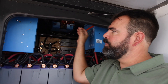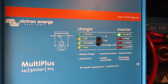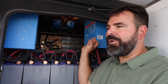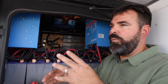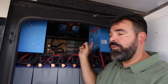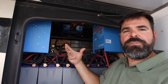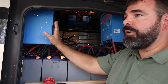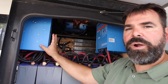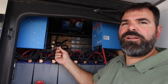These two big blue beauties are our Victron inverters — they're 24-volt, 3,000-watt inverters with a built-in 70-amp charger. They're set up in parallel right now, so they're working together. When one needs a little bit of extra help, the other will kick in and push all the available current to the necessary items. Right now these are running our air conditioners. One thing that's so nice about these Victron inverters is they are programmable — you can arrange them in multiple different configurations. Right now we're wired in parallel, but they can also be wired in split phase or multi-phase.